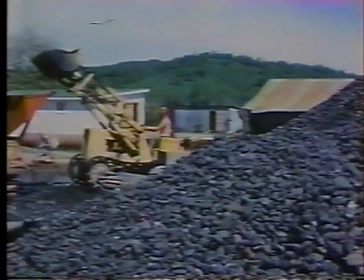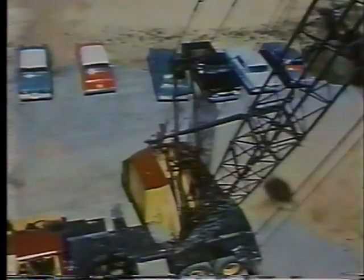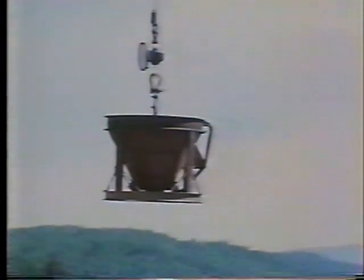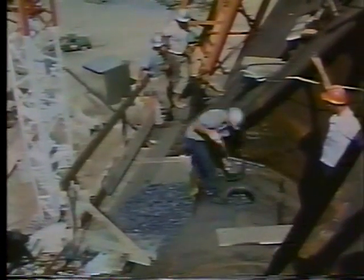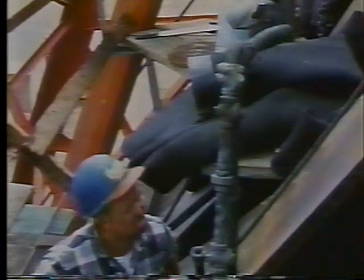High-density ilmenite ore was washed, graded, and weighed. Using a portable crane, the ore is hand-placed inside the counterweight sections of the shaft and yoke. About 40% of the laid-up volume was in voids left by this iron ore. The dry aggregate was pumped full of ferrophosphorus mortar, finally to yield a concrete with a density of 250 pounds per cubic foot. Almost 850 tons of this concrete were so placed.